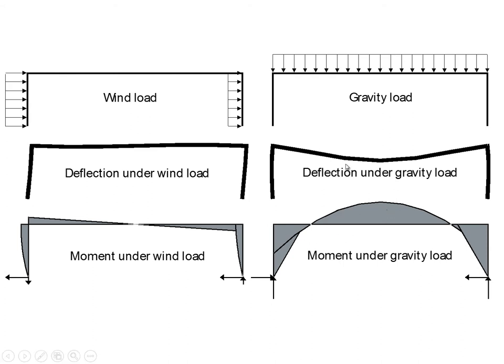We see a positive moment at the center and negative moments at the ends due to gravity loading. Since gravity is the dominant structural burden, we realize we don't need moment capacity at certain locations. However, at about 20 percent in from the end, there is some moment induced by wind load, so we can't put a pin joint there exactly.